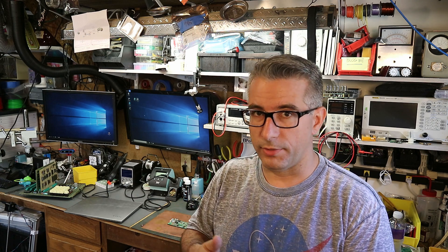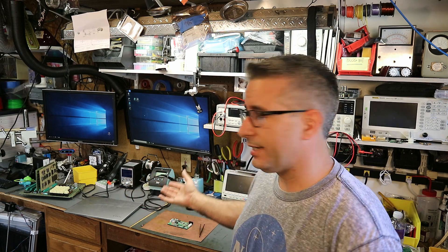The upgrades go from like $35 to $100 to thousands of dollars. I found something on Amazon Prime — I actually haven't found it on eBay — but two days. It's this 996D that I have now. I think I gave like 90 bucks for this thing. It comes with a soldering iron, which I don't use, but the hot air machine itself seems pretty decent. I'm guessing it's pretty much the same thing internally. The 996D pretty much works the same way, almost all the settings are the same. You run like 2 or 3 for fan speed and that seems to work out pretty decent.